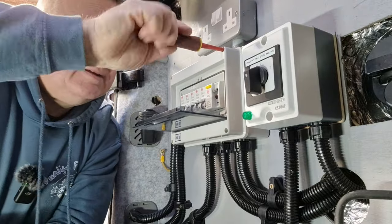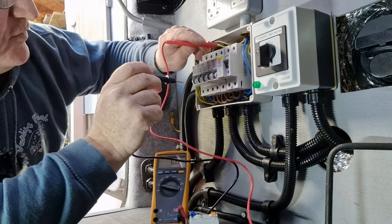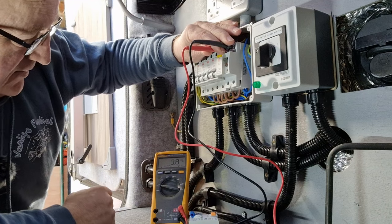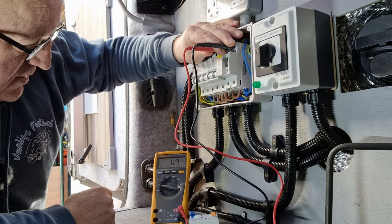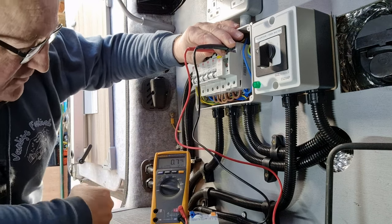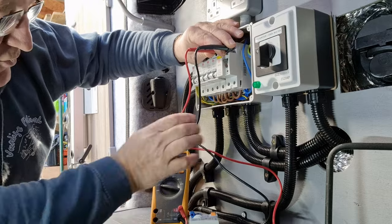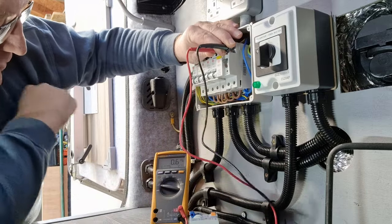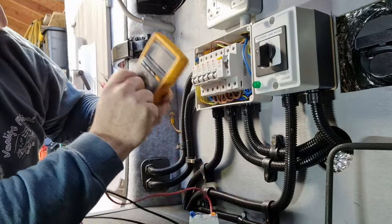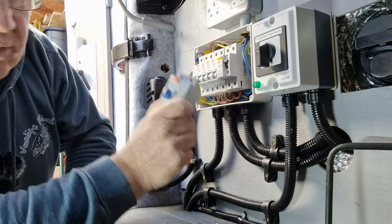Right, just got to prove it's dead. Multimeter there, currently set on AC — there's no voltage there, that's 0.7 millivolts, way low, that's probably just interference off the cables. I'm happy — no voltage there. Invest in a good multimeter. Let's swap these out.